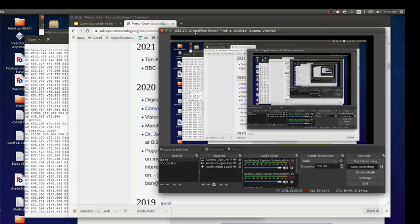There's two ways. We did raw block straight into a wall, but they will settle. At the end of the day, they'll settle like 3/4 inch at the very top ones, because there's some moisture, and the moisture evaporating from the block will make it settle. Very little per block, but if you've got an 8 foot wall, you'll get about an inch of settling. Would it be possible to use a dehydrator? You can't really speed up that process. You actually want them to dry very slowly, otherwise they'll crack.